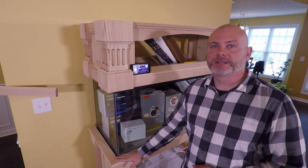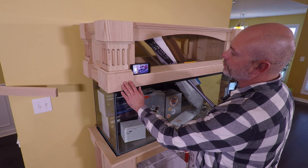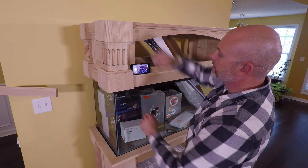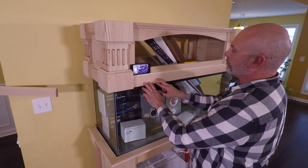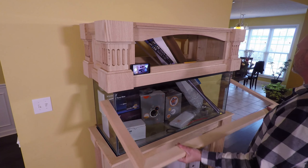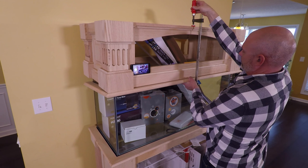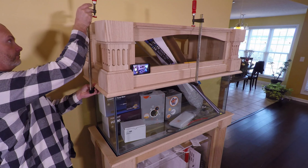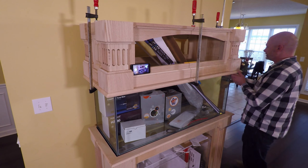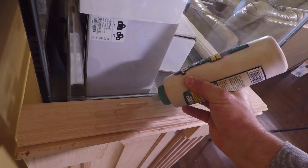At this point, I've already connected what I'm calling the mantelpiece for the stand, but I want to make that same connection at the canopy. A couple of things to be mindful of is that wood grain that runs this direction tends to expand and contract more this way than it does this way. So because of that, I'm only going to make glue connections where the wood grain will match the wood grain, and that should allow these columns to expand and contract with changes of humidity without weakening the joint and causing this piece to fall off at some point down the road. I can mark where my boards are going to be, and I'll know to put glue inside of that pencil mark.